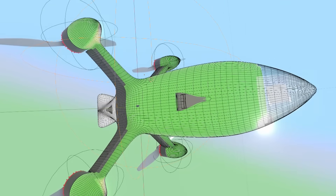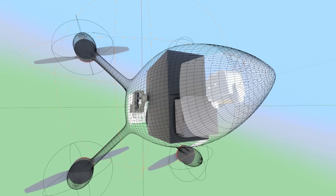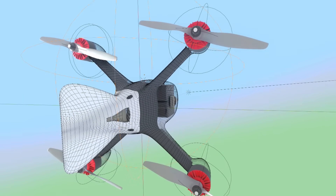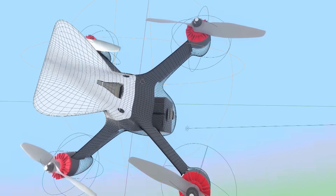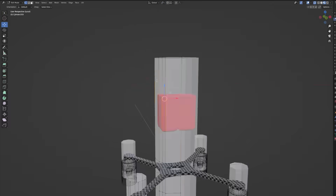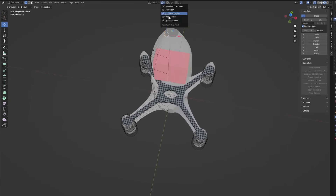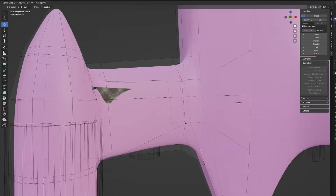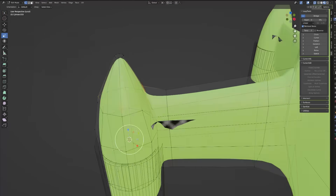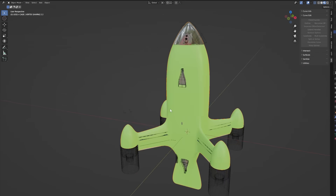For maximum speed, this was primarily a task of wrapping the motors, the arms and the battery inside the most efficient streamlined shape — making the shell no larger than absolutely necessary, with the battery corners a mere one millimeter under the surface and the motor cones precisely aligned. The shape starts out as five cylinders. For the arms, these rectangles are bridged and the software generates elegantly sculpted, streamlined curves. I meticulously tweaked the vertex points till the shape was just right, then subdividing the mesh into ever smaller rectangles until the flat faces disappear into a continuous curve.